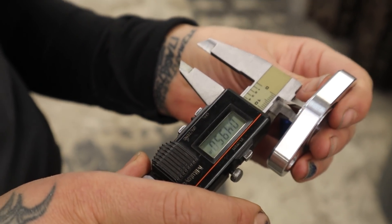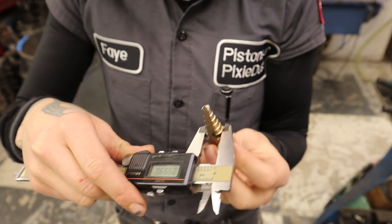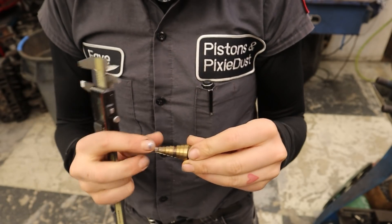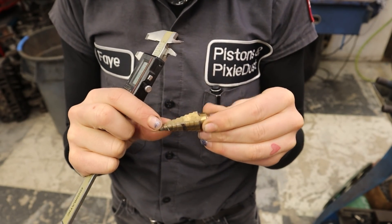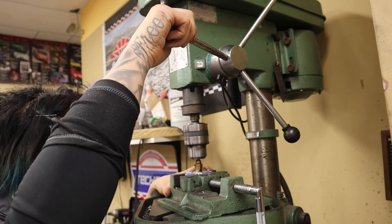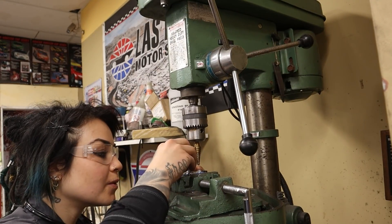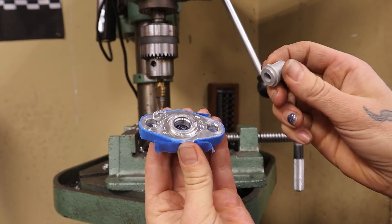Oh my God, it's actually incredibly close — 0.495. Well, got a little boring to do. So we have this little step bit here, and that is really close. We're at 0.558, which is why it's marked here. So I'm going to go to this, maybe a little bit above, and see if I can get this as close as possible before Danny welds it. Let's do it.